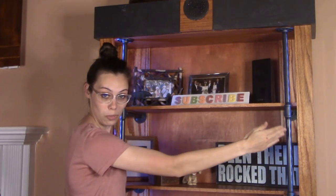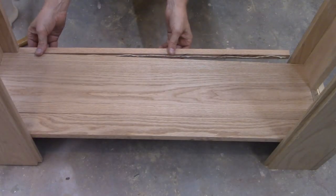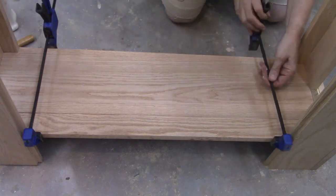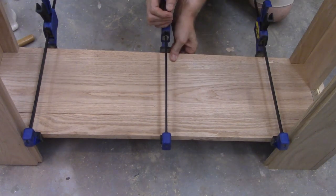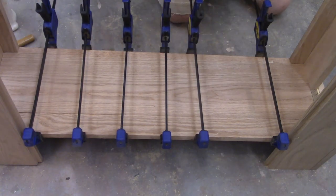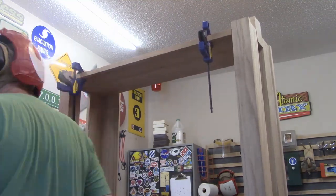Now these pillars are super cool — the most amazing thing ever. But since we just made the top part and also the bottom part, it created a gap and we needed to fill it. We may not be dentists, but we filled the gap. A strip of wood is glued on to fill that gap, which will give us a wider shelf. Lots and lots of clamps are used to hold it in place to make sure it's invisible once the paint dries — and we were actually pretty successful at this on both the top and bottom shelves.